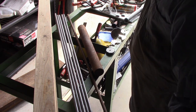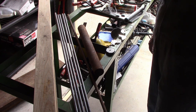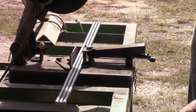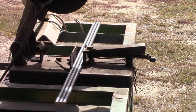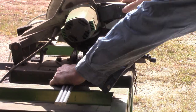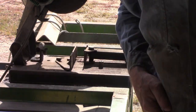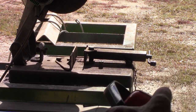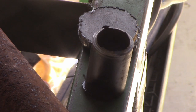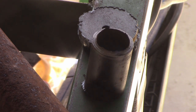I had to buy these rods for the spokes. I didn't have enough of any 10 or 12 mil - 10 mil's fine but I didn't have enough of it, so had to buy that. But everything else is out of the scrap box so it's going to be a fairly cheap anchor. I was going to cut these in half - I want roughly 600 mil for each length. They'll give me plenty of weld, make sure it's nice and strong. Let's go and give those ends a bit of a grind to get the sharp edge off them. There's a small sacrificial piece of pipe I'm going to use temporarily while I bend some rod - I'll just cut it off afterwards and put the rest back in the scrap heap.